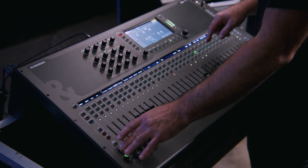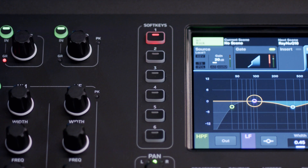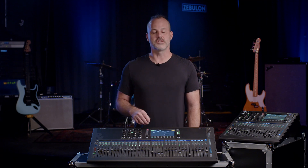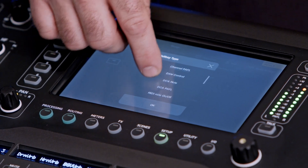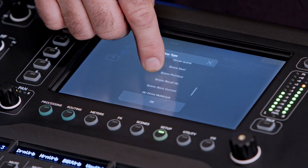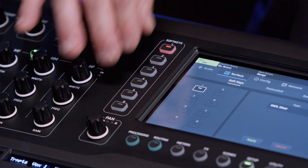You can even have duplicates — if you want to keep something in place, assign it to all four layers and it will always be present. Across the range of this updated Cue line, we have eight user-defined soft keys: six along the left side of the screen and two additional in the lower right corner. You can go into the setup menu and choose from a variety of functions including mix selects, channel PFLs, MIDI commands, mix sends on faders, and more. When mixing a show, I commonly use soft keys for mute groups, all mute, and scene management.